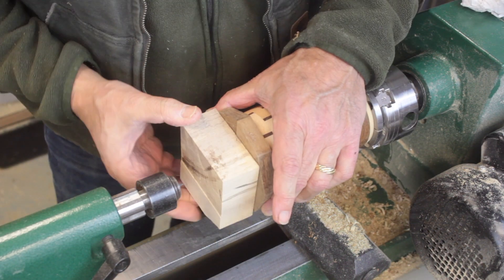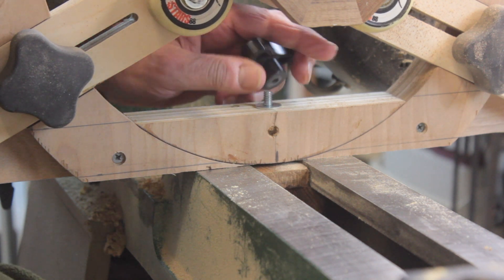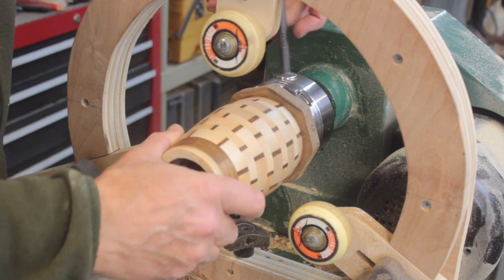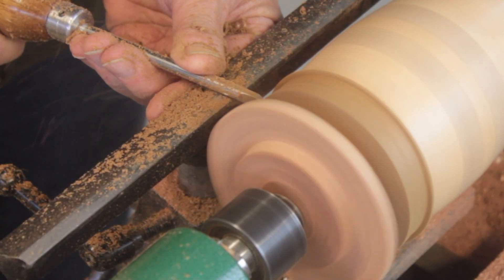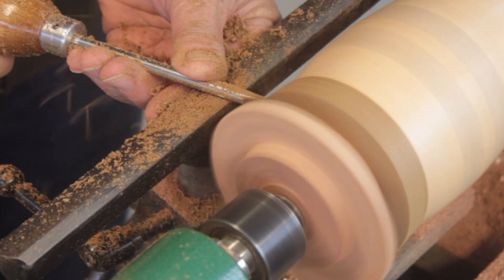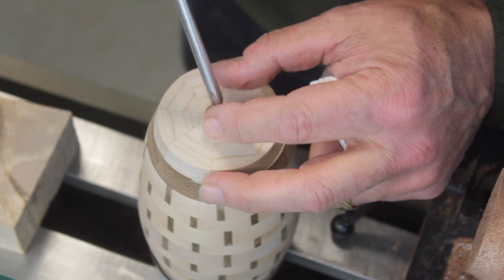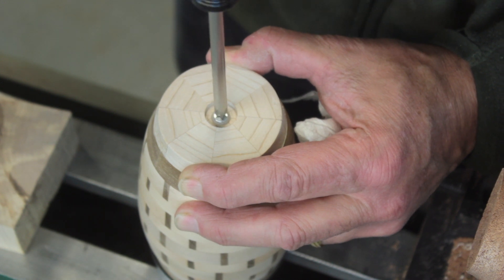I used a block of wood and the tailstock as a clamp and let it dry overnight. Not taking any chances, I installed my steady rest and cored out the top of the mug. I reversed the mug and cleaned up the bottom, then reversed it one more time and shaped the upper rim with a detailing tool. I checked the fit and sanded it with 220 and 400 grit sandpaper. Once the top was done, I made a new segmented piece for the bottom. I test fit the piece with the screw and everything fit.